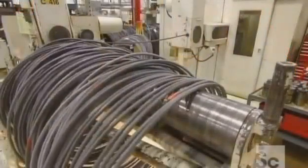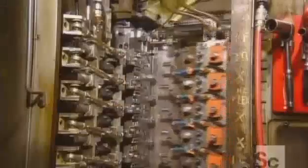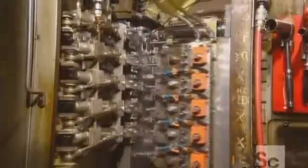They start with this coil of thick steel. It travels through a die which straightens it to a knife that slices it into short billets. A machine then drives a series of forming tools into the billets. The tools force them into a socket shape and create the all-important hexagonal opening that matches the profile of the nuts and bolts.